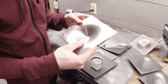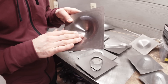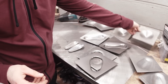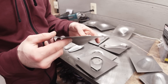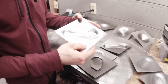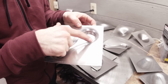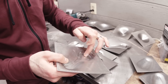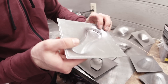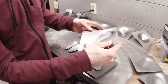I went to a cone shape — this one's in stainless steel, this turned out really nice. The stainless is quite thick. This piece got pretty warm while we were forming it, that was kind of interesting. I tried the same toolpath in titanium and that worked out, I like that. I tried these shapes which had a little bit of a material failure because I was trying to go too aggressively down without enough draft angle. That taught me something there. And of course the same thing happened in titanium.